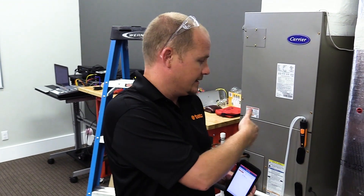The reason you would take this measurement is because in many cases you may have an air filter that's restricted. It could be because it's dirty, but it also could be because you have more airflow moving over a particular filter than it's designed for — this is actually more common than you may be aware of. Using a static pressure drop test like this can show you where the source of an airflow problem may be stemming from. It's a very practical test to do.